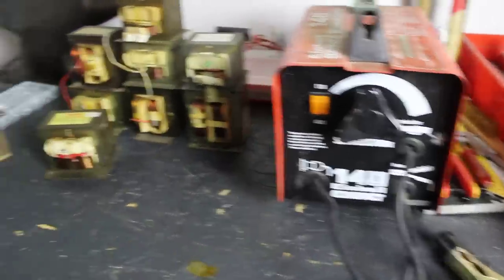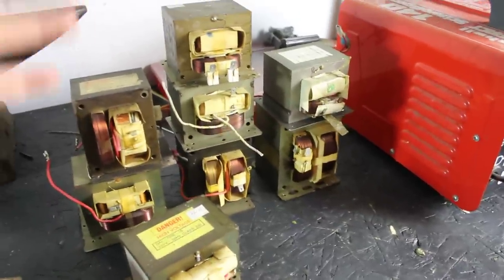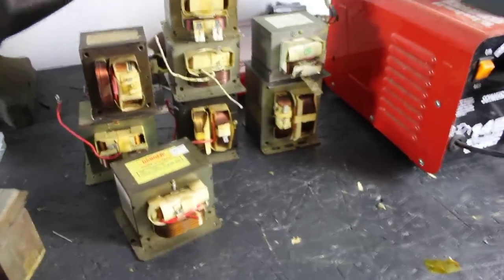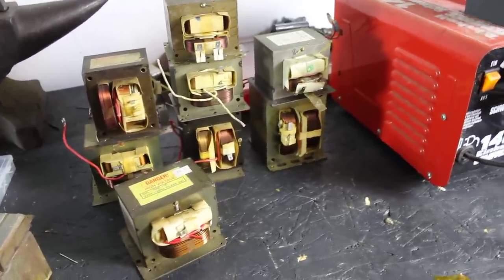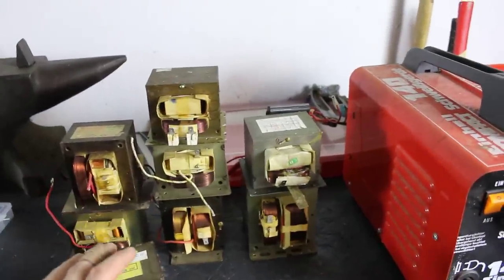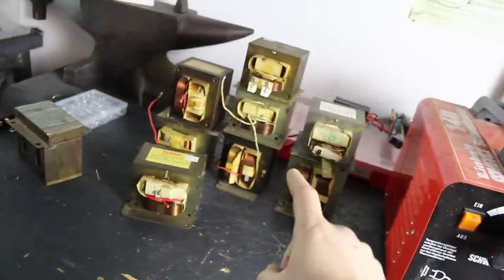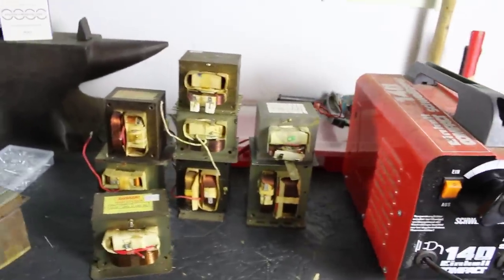In a very similar way I'm also trying to finally build my own current source for a welding machine from these salvage transformers. People call these MOTs — that's for microwave oven transformer, because these are salvaged from older microwave ovens. I'm going to modify these transformers and get to the point where we have another AC current source, and from that point on the upgrades for this machine and for the self-made MOT welder will be practically the same. That's why these projects work alongside each other.